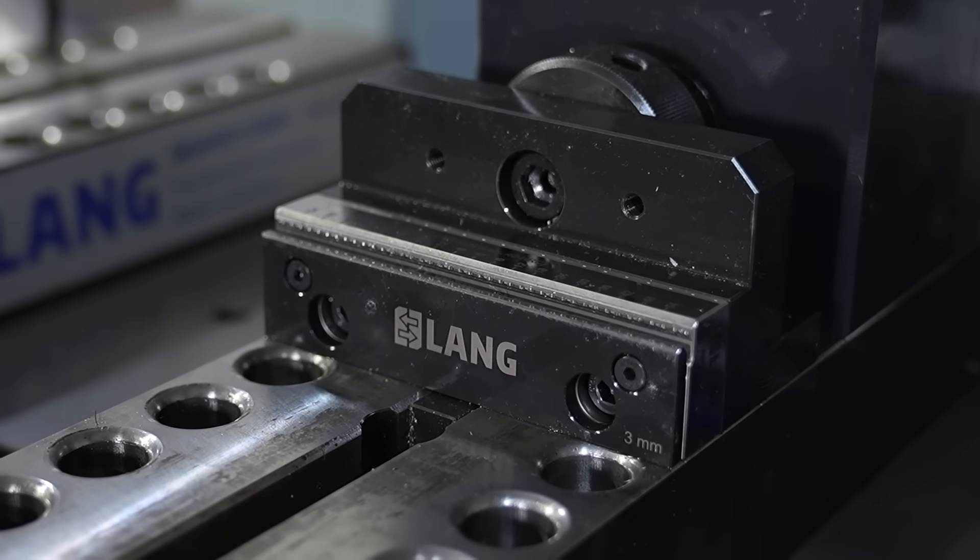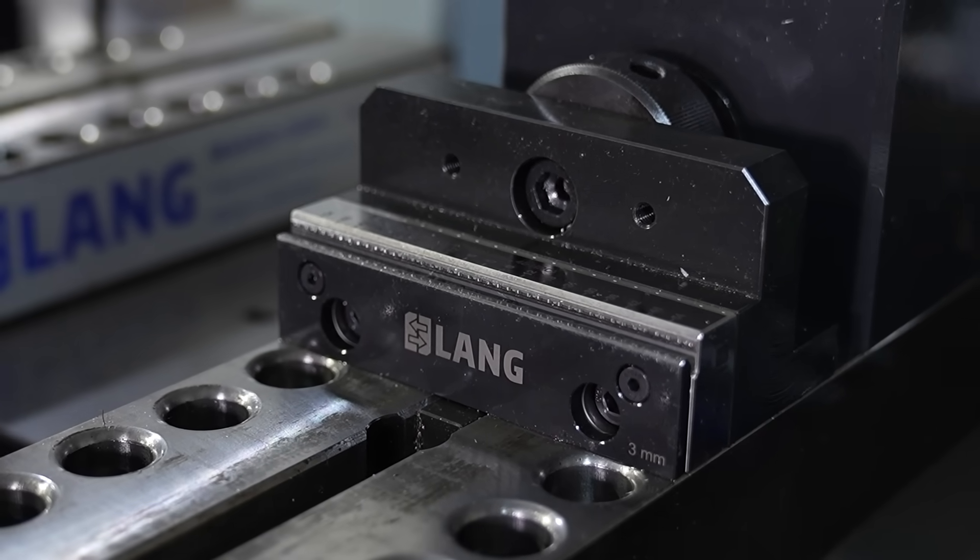The reason for doing that is so that when you clamp the material inside the machine, you can get extremely high holding forces from a very low input torque on the vice. That means you're not putting any unnecessary force into the bottom of the material, so when you finish machining and you've removed a lot of material, it's not relaxing when you undo the vice — it's clamped in as close to a free state as you can possibly get.